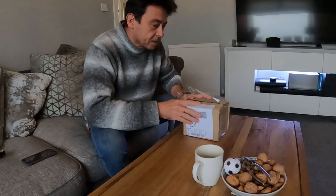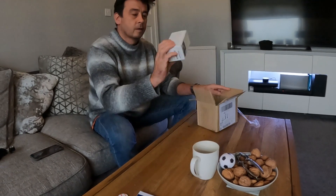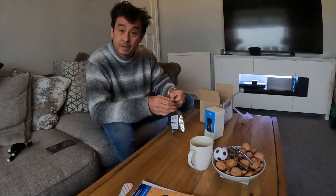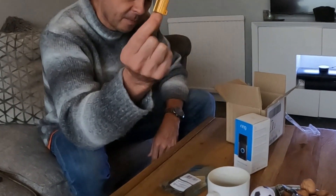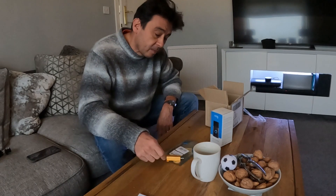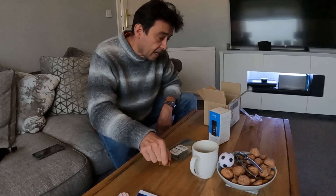Here's my Ring doorbell - what's in the box? Ring camera. I've also got some of these little things - these are resistors and they're going to hopefully give me a bit of protection to the circuit. They're a little inline resistor and the idea is that you use these when you're using a hardwire adapter for your Ring camera. I've already got the hardwire adapter and you just wire these in series. Piece of cake.